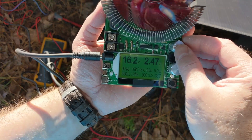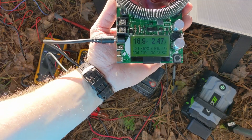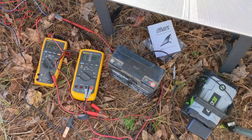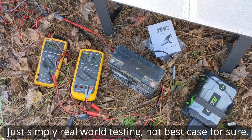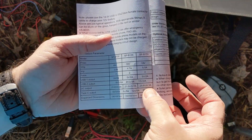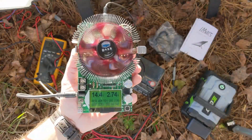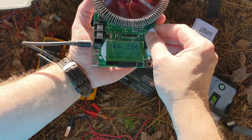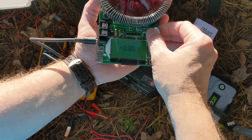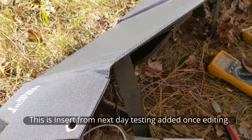We're right at 40 watts — about 42 watts is the max I've gotten out today. Holding about 16.9 volts at 42 watts. Not bad to be portable, really. I know it's supposed to be able to do 150 watts in optimal conditions, and the DC output max on the B150 is 23.6 volts at 6.3 amps max. On the day of my testing — the first day I had sunshine in quite a while — I'm able to get up to almost 3 amps. To be harnessing the power of the sun, not even on an optimal day, I think it's going to be very handy.